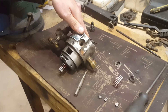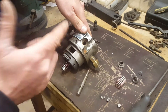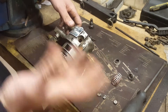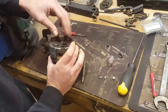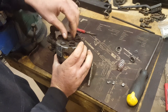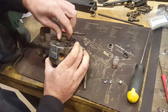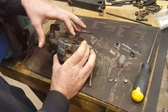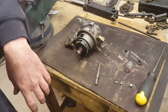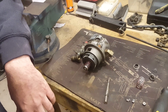Parts are available and they're not expensive, while hydraulic heads themselves are quite expensive. The only other way they fail is if the plunger itself wears out or galls. Make sure you put your center bolt back in before you put it on the truck — I believe the torque on that center bolt is about 45 foot-pounds, but check your TMs to confirm. That's about all there is to repairing a hydraulic head. Hope this has helped — please like and subscribe if you haven't already, and we'll see you on the next video.